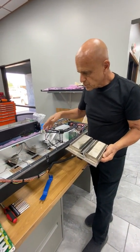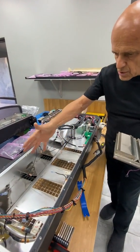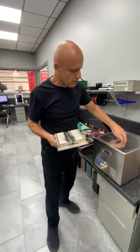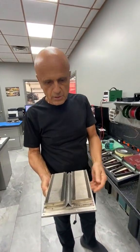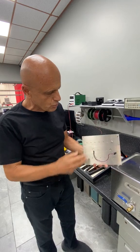One of our new procedures is going to be to take all the heat sinks out of these power electronic modules, clean all of that dirt out, and then put these heat sinks into an ultrasonic cleaner, which is going to loosen and remove the remaining dust and debris on the fins so that the power electronics module can run as cool as possible.